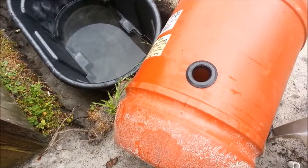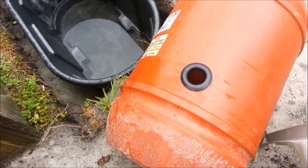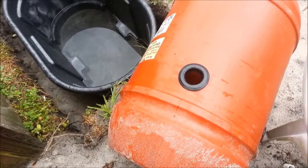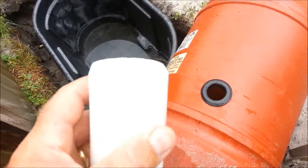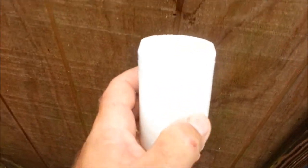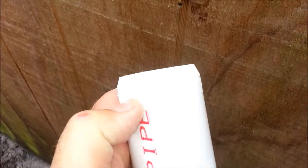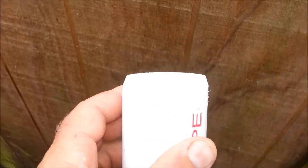If you have any questions about the Uniseals — they're a great product and I love using them. They get rid of a lot of headaches, but installing them can be a little bit daunting. If you make sure you put that little bevel in there — just take your grinder, or a Dremel (though you'll get dust all over you using that) — and put that little edge around it. You can probably even get a little bit more of an angle, which would probably work better, but that'll help you out a lot.